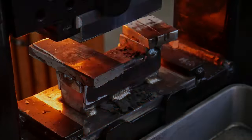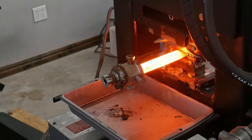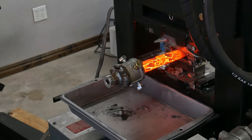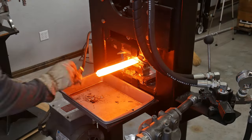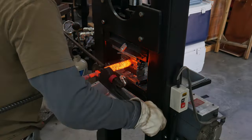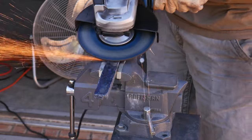The drawing process starts by making it into one large square bar, then knocking the corners off to make it round. This prevents any cold shuts along the edges of the bar when twisting, which reduces material loss during cleanup. With the bar drawn out, I clamped it in my press and attempted to twist it with my rigged-up drilling attachment using both my drill and impact. Clearly part of the problem was the large diameter of my billet — if using a hand twister, the OD needs to be much smaller. I also had a hard time getting a good bite on the end of the billet, so I called an audible and resorted to the tried-and-true pipe wrench twisting method. With the bar twisted, I drew it out to a very flat and thick piece.